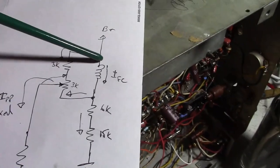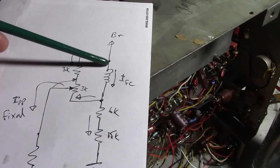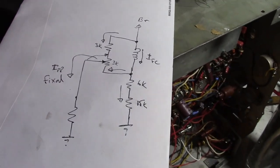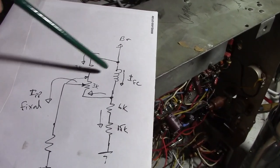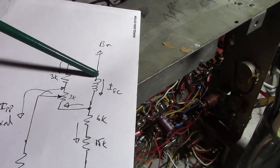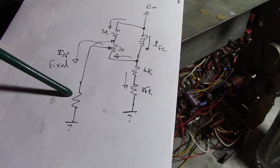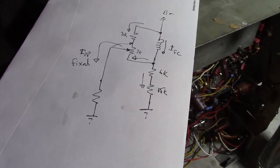The simplest thing I could do is just break this connection here and throw in like a 500 ohm resistor — I just want to see if that shifts things a bit. We'll still be getting most of the current going through this way and even less going the other way. What I'm wondering is if I add 500 ohms here, do I need to take away 500 ohms on the other side to get the right amount of current going down to the audio stage? I don't want to starve that thing of current. Here it is with a 470 ohm resistor put in series with the focus coil, and unfortunately if anything I made things worse. And yes, we still have arcing in the neck of the CRT occasionally.